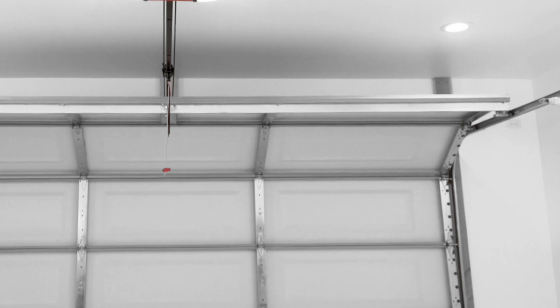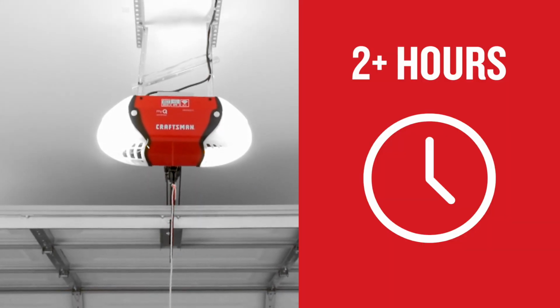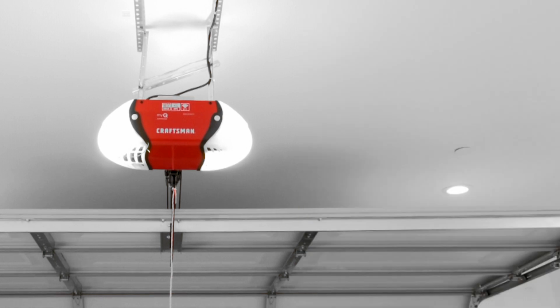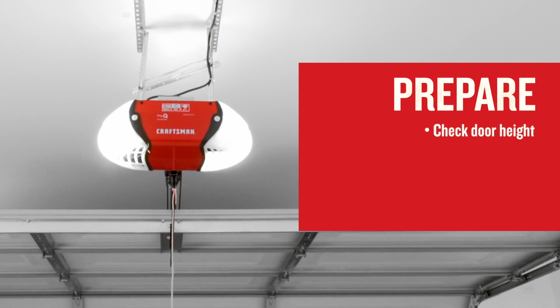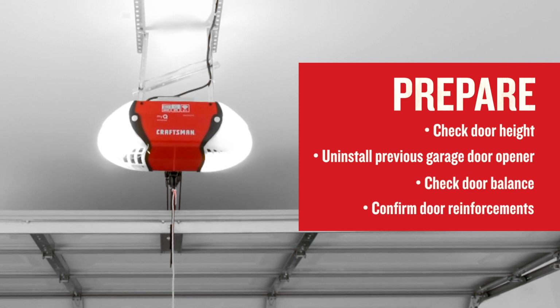You'll begin by assembling your garage door opener, and then you'll install it. Plan to set aside a couple of hours, but you may need more time. There are several things you'll need to do to prepare for installation. Confirm the height of the garage door. Uninstall the previous garage door opener. Check the balance of the door. And confirm the door is reinforced.